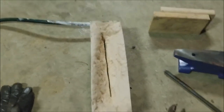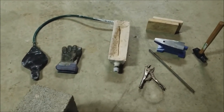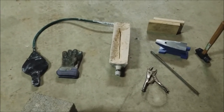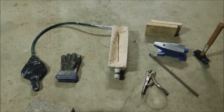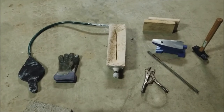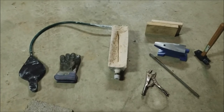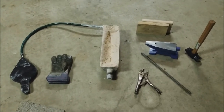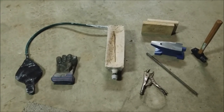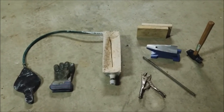One thing also, guys, is if you do end up making a forge like this, there are some cases where there have been instances of air pockets in the plaster of Paris, and once it heats up, you get a blowout, and it just sends shrapnel and metal and stone and sand flying in all directions. So I'm going to get this going, get it cranking, get it pretty warm, and then step out and watch it from a distance with safety glasses for, I don't know, maybe 20, 30 minutes. And yeah, we'll see how it goes.